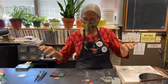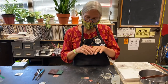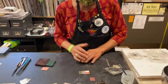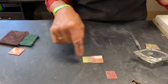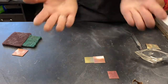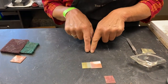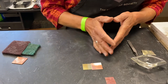If you first segregate those out and say, this one's going to heat up faster, this one's going to heat up slower, this one's bigger so it's going to need more heat — you really want to logically think when you set up to solder. My copper is a little bit bigger, but I also know it heats up faster, so I'll probably be able to evenly heat both sides and get my solder to flow. One thing I learned early on is you can actually see the solder chip march to one side before it even melts, gravitating toward where it's the hottest. That's a warning sign to get over and heat the other side.